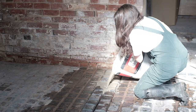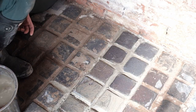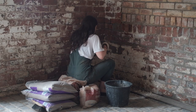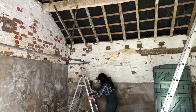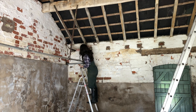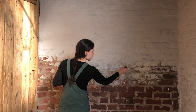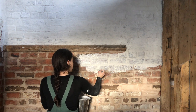To do this I mixed some concrete and learned how to do that, and a friend also showed me how to point brickwork. So I started working on repairing all the interior walls that had lost a lot of their mortar. Pointing took a while — there was a lot to repair — but I finally got that done. Then I started painting the walls with a fresh coat of lime wash, which I chose because it should allow the bricks to still breathe.